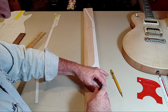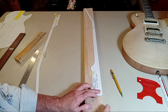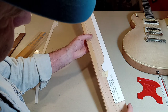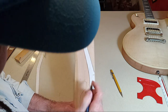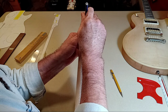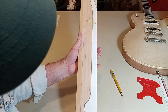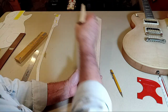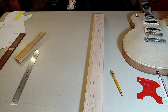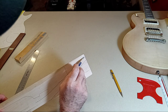Anytime you see me draw a dashed line, it means it's undecided — or in other words, I'm assuming it's correct, but there's a possibility it's wrong. That's a dashed line just because I couldn't reach it. That's a constant. And probably one of the most important things: you're going to verify the length. Because once you pull this template off, you'd be surprised — if you had forgotten to draw that end line right there and your templates weren't very accurate...